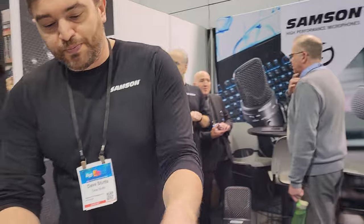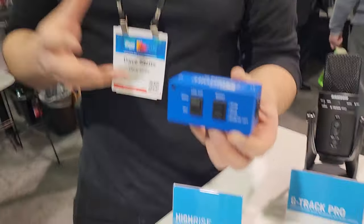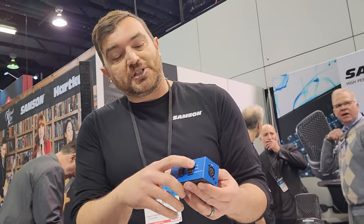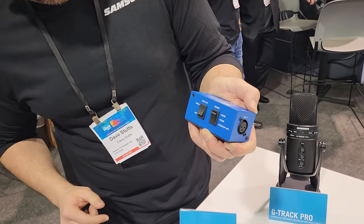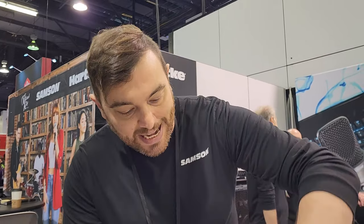Then we have the Hi-Rise. This is a really exciting product. A lot of dynamic microphones don't have enough juice to get them going, so you have a noise floor. This gives you up to 30 decibels of transparent, clean boost. On top of that, there's also an option for a high-frequency lift for more clarity in your vocals, as well as a 120 Hz low-cut to remove a lot of the mud and low frequencies. Really great for podcasters who need to get that juice out of low-powered microphones — good for podcasters, musicians, and singers. It's also powered by phantom power, no extra wall adapters, just plug it in and it's ready to go.